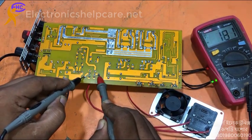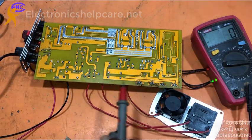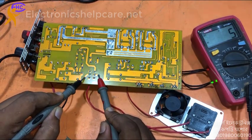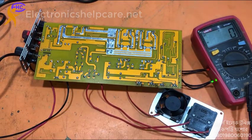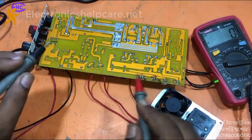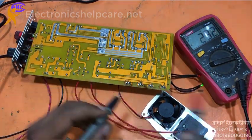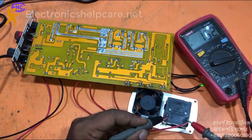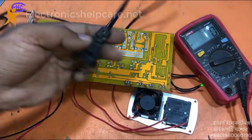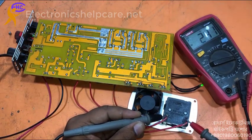Relay input has voltage but output has no voltage. I am going to plug in now — it has voltage with direct current. I removed the direct current and the inverter is on but still no output. The relay is stuck. I just tapped the relay a few times — now look, the relay is okay and working.